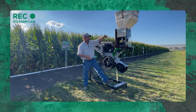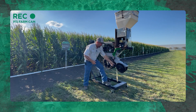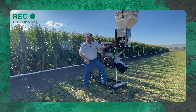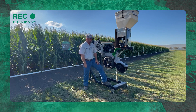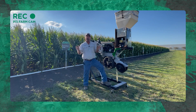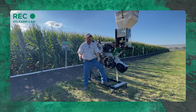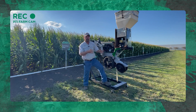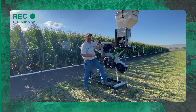We've got a Gandy box driven by a hydraulic motor. We're bringing fertilizer through this drop tube, and it's coming right before our closing system on the planter as we're planting. So we're banding these micronutrient dry fertilizer products out in the field. I think this is kind of a crude version of doing this on the planter, but it worked very well this spring. We're going to get some good data on this.